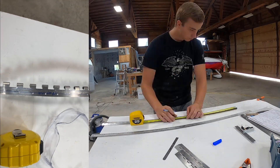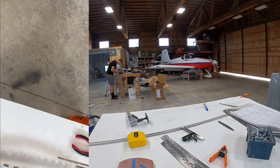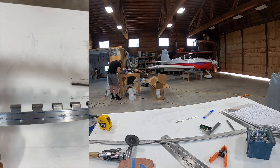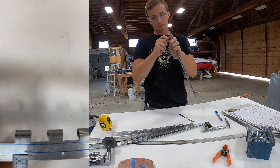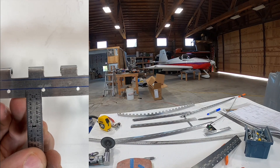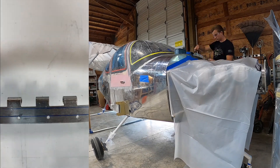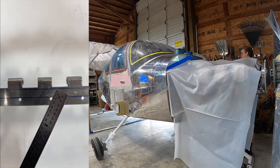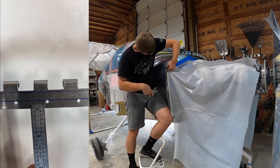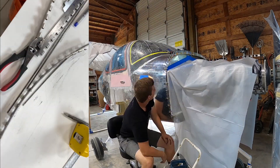There is a slight downside to doing your cowling hinge pins this way. If you're precise both drilling and setting it up, it's not a big deal. But if you're not precise you could easily blow past your edge distance. I've got edge distance plus a 64th, so it's fine, but if you don't pay attention it's really easy to go straight past your edge distance. Make sure you still have your edge distance, then deburr, countersink, and rivet it all on.